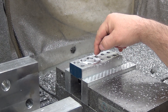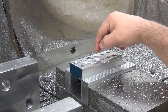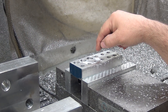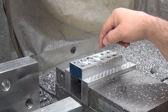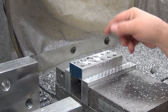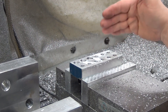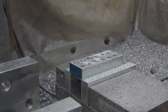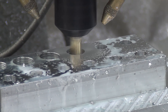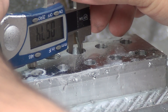For the next one I went ahead and told the thread mill to go out 15 thousandths more, so it's a negative stock-to-leave of 20 thou right now. We'll see what that does — instead of keep sneaking up on it, let's go too far. If this one's still too tight I'll go another 10 or 20 thou. Reading is 0.574 again.